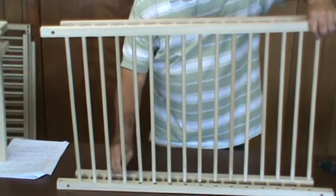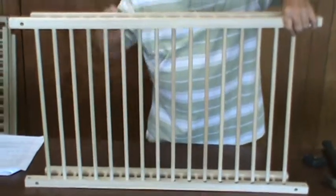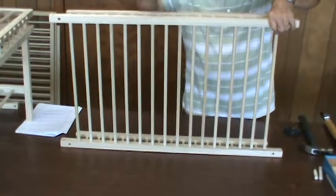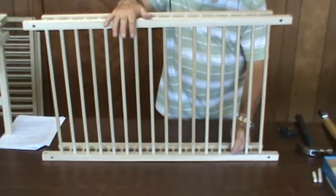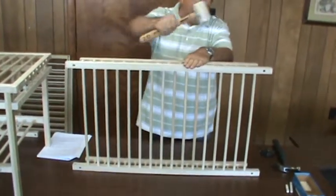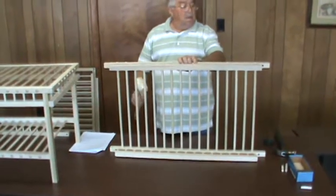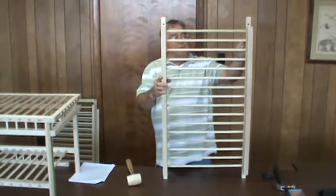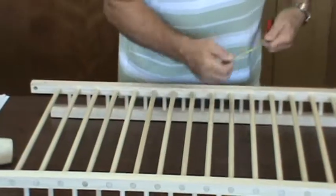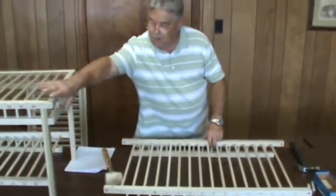This step is a little harder to guide. Make sure you taper the ends well. Once you get some of them started in the holes, tap a little and work your way across until they're all in. Use a rubber mallet or hammer and tap it down until you have exactly 20 inches when finished. You'll have a little space left for the buttons, but getting 20 inches all the way across is important for your corners to fit correctly.